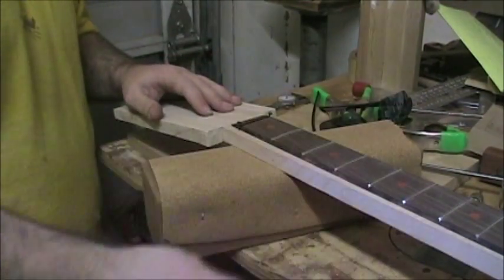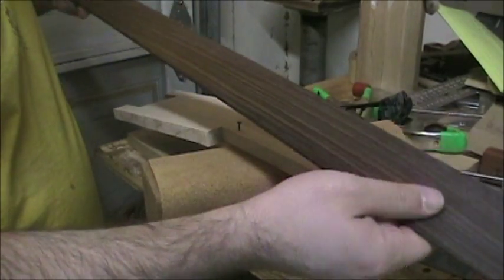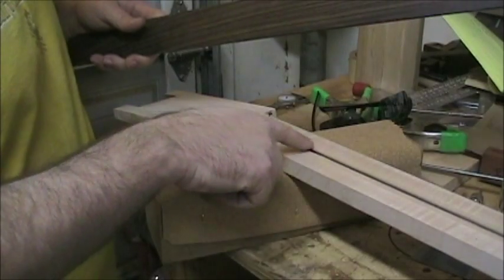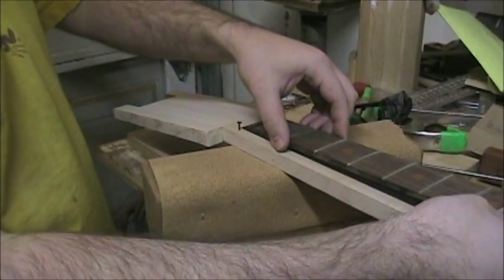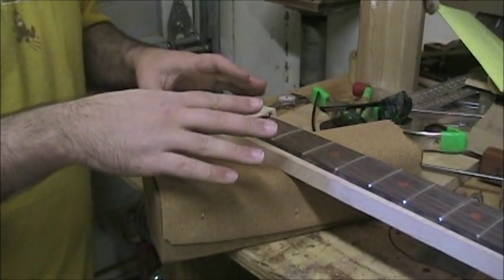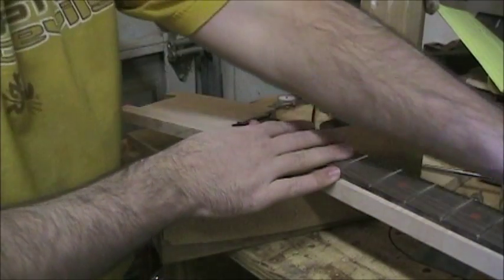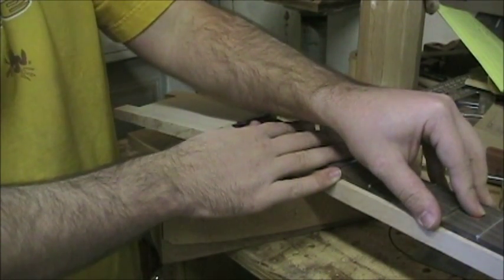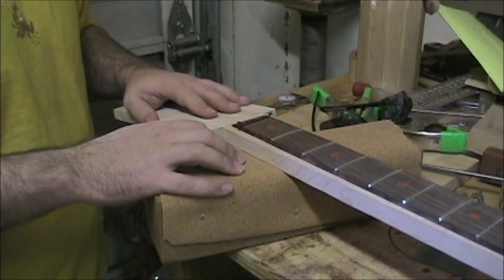What I'm going to do is come back now, get the back of this loaded up with glue, and go ahead and glue it on there. All I'm going to do is slide this out, put glue all over the back of the fretboard, and get it on there really, really good. I'm going to put a little bit on the neck too, but I'm going to try to avoid the area directly around my truss rod so we don't get any glue down in there — the last thing you want is glue in there making your truss rod struggle. I'm going to clamp with light pressure all the way down it, check to make sure everything's lined up, then start torquing down the clamps back and forth evenly so it doesn't come out of alignment. The fretboard is almost exactly the width of this neck blank, so I can eyeball the bottom side, and we'll be ready to start working on the body probably after this.